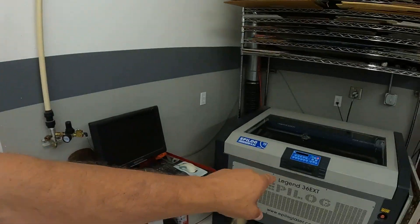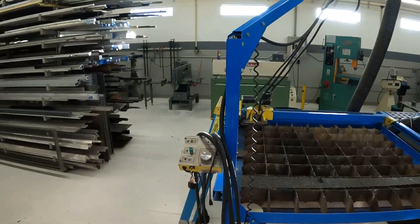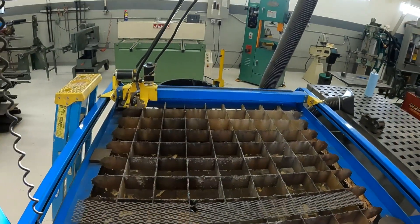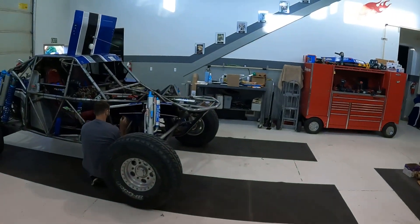This shop is neat — there are a lot of tools we get to use. We're going to get close with that cardboard by cutting it with a knife, then draw it up. After it's drawn, we're going to cut it in the CO2 laser. After the laser, the drawing will be perfect, and then we take it to our CNC plasma cutter for the final cut. We did this for all of the parts on the five-car, made almost everything out of cardboard first, and it saved so much money and really gets you accurate drawings.